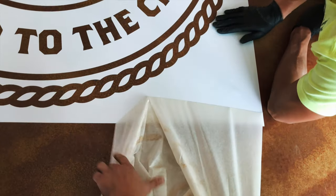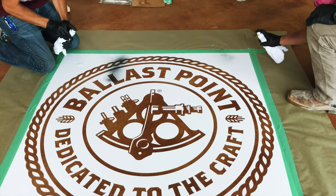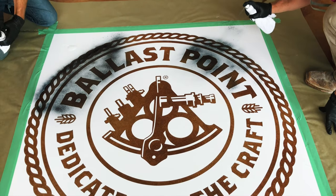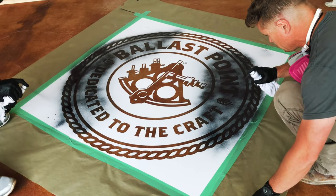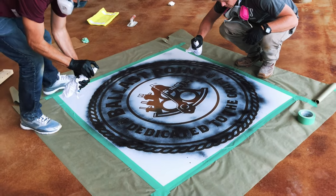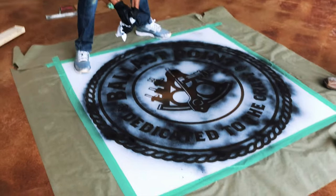When we got the sticker stuck down, we used these Pre-Val sprayers — basically a glass jar you put the dye in and it turns it into spray paint. We just spray painted the dye in there, but that's tricky because you have to hold those things at a 45-degree angle or the acetone will spill over everything and ruin what you're doing. We were minutes away from completing the job with the first coat. We had bottles of black dye and had to be careful not to let them drip. If you spray it too heavy in one spot and it puddles up, it'll bleed under the stencil. You're basically misting the stencil and doing multiple layers of mist until fully covered.